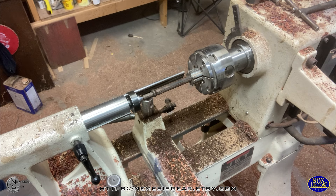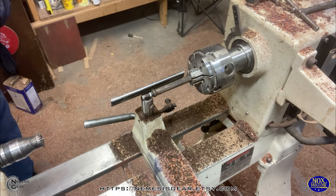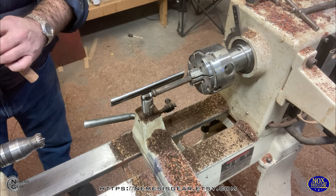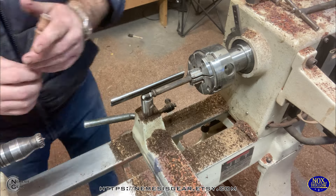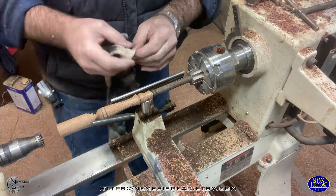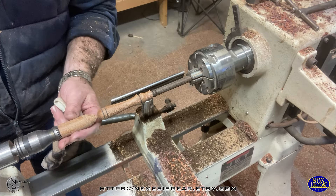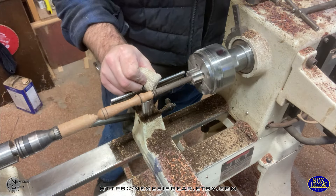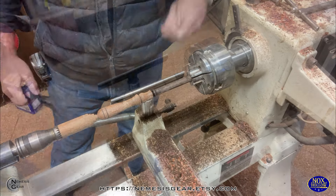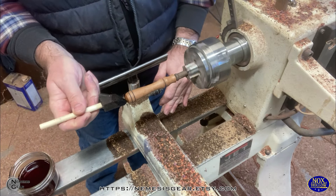One of the things I found when gluing these up, especially when you have a good tight fit like this, is you really need to cut a couple of grooves on the sides. When you put the glue in and put this together, if you just clamp it up without putting a groove in there, the glue and air trapped inside that hole doesn't have anywhere to go. If you cut a little groove on the sides of your tenon, when you clamp that down, it gives that excess air and glue a little bit of an escape path. Then I just wipe off that extra glue with a damp cloth and let it sit overnight to dry.